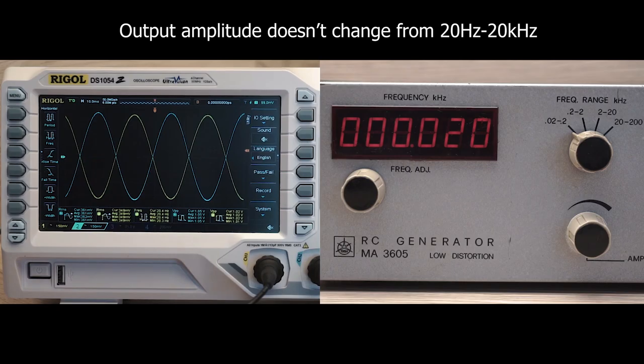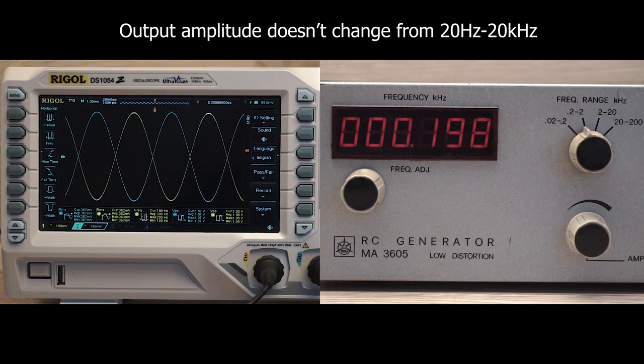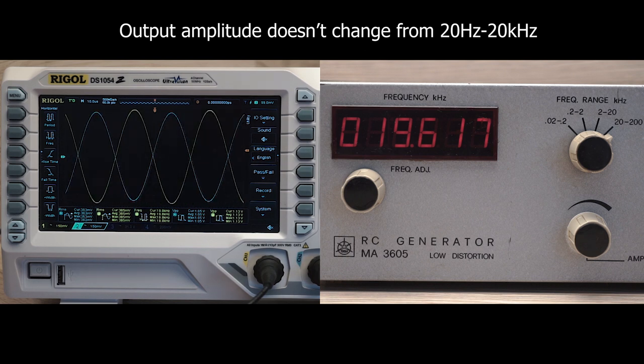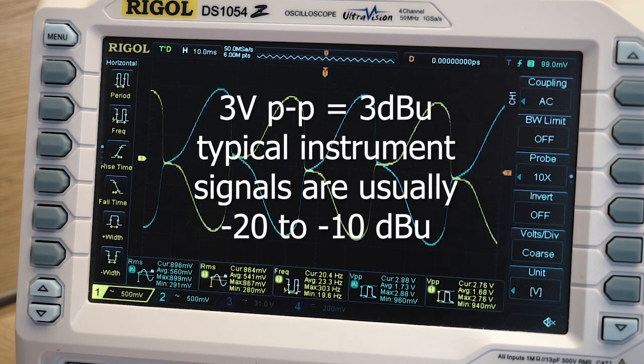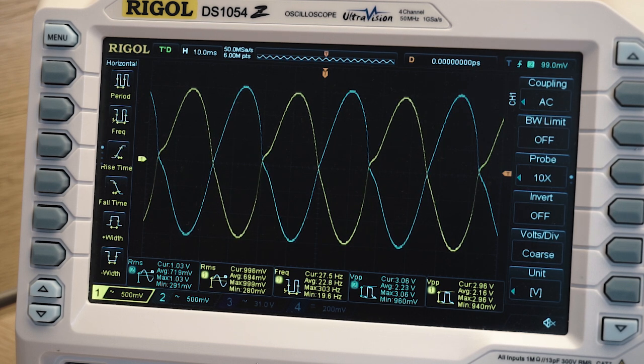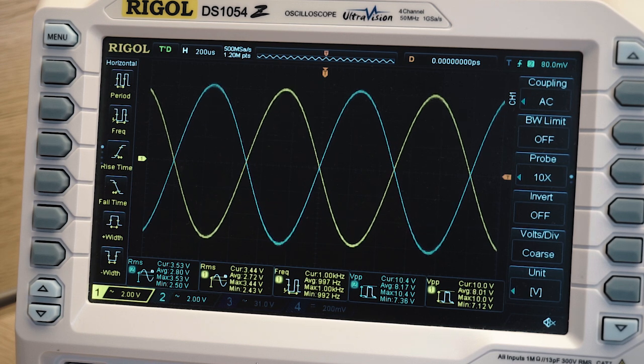Yeah, everything works fine, so let's see if the box actually has a flat frequency response. If we push 20 Hz signals through with a bit more volume, we get this ugly looking waveform, but that's at about 3 volts peak to peak and disappears quickly with higher frequencies. At 1 kHz we can go pretty crazy with voltage and it won't distort at all.